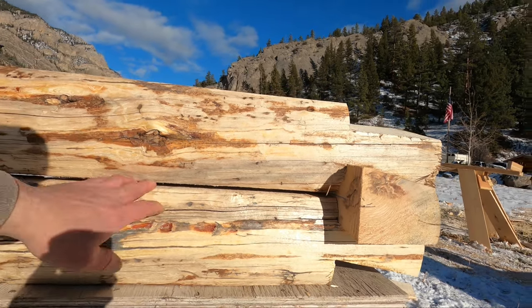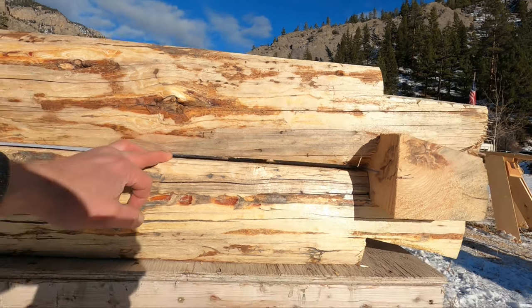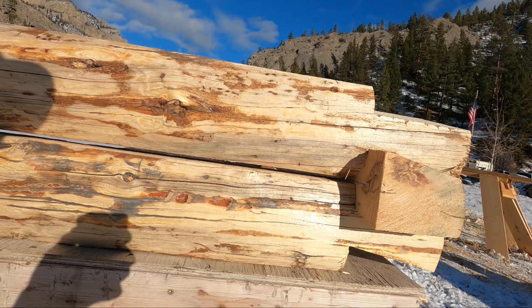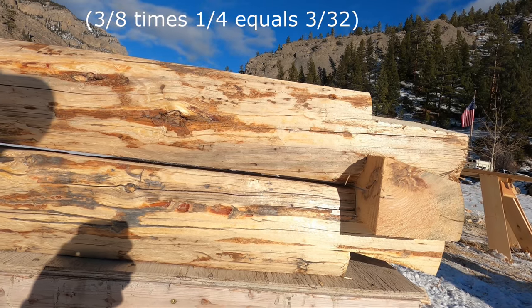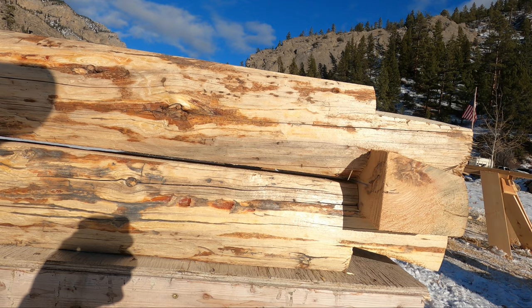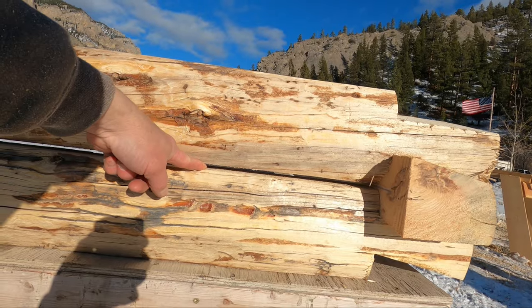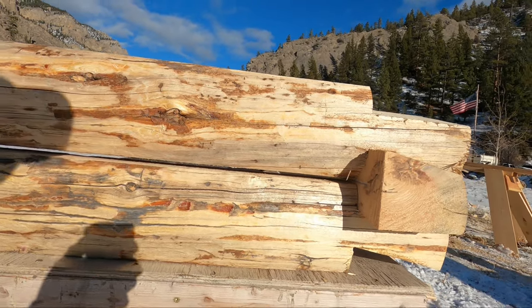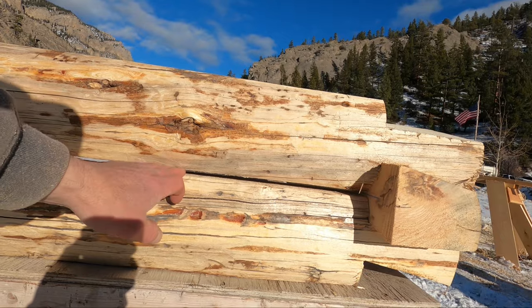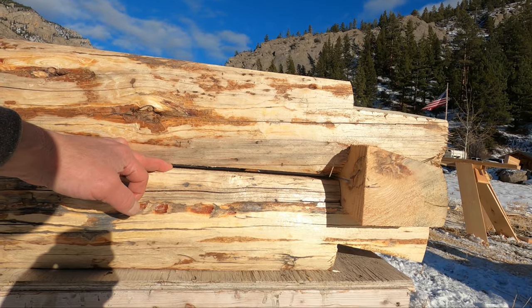To reduce that gap, we need to eliminate some of the space between our saw guide and the bar. If we have three-eighths of an inch, we want to remove one-quarter of that dimension, which would be about three-thirty-seconds of an inch — hopefully that's close to one washer. For every adjustment you make on that offset, multiply by four and that is the change in gap. So if I adjust my spacer by a quarter inch on the saw bar, multiply by four equals one inch change in gap. Here we just want relatively minor adjustments, and hopefully one washer is going to do it.